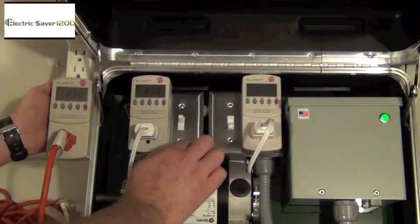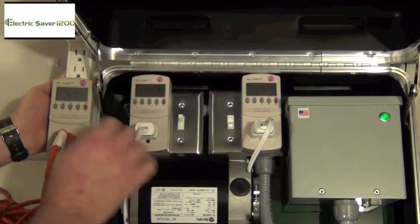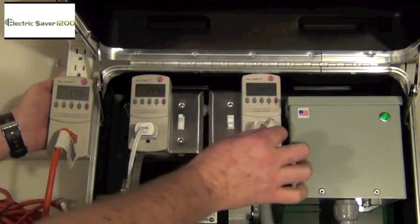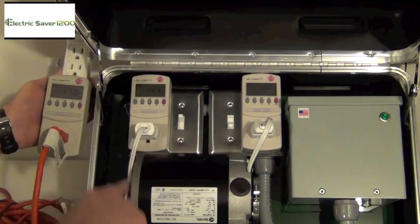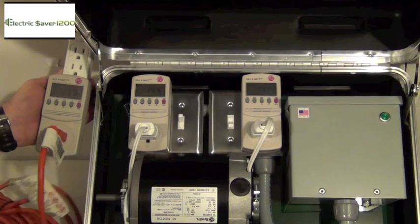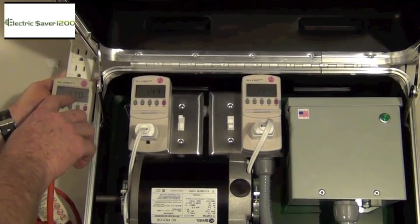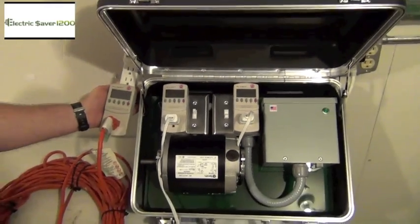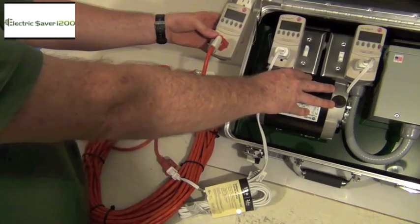So what we need to do is turn this off, bring everything back to the same again, and flip everything over to watts. Right off the bat you're going to notice you have 144 watts coming from the motor, 144 watts from the board total. But once it goes down through all this cord — this 100 feet of cord — you're now noticing that the power company is actually billing you for 170 watts when you really only need 144 watts. This is why I've been telling you guys you need to have distance between the power company's electric meter and wherever the motor is that you're going to install this.